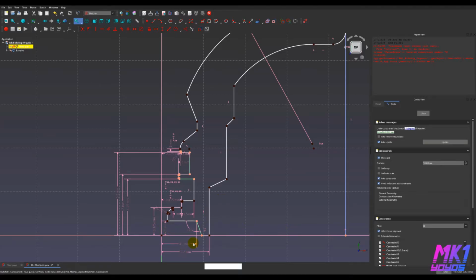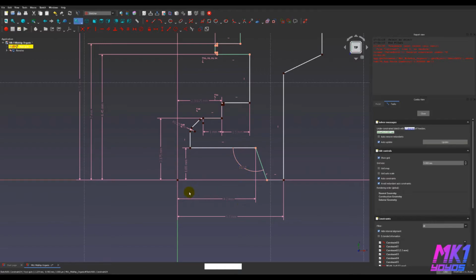So, quick note down here. The axle is 8 millimeters long on this design. So I've made the hole 4.2. This is on one side of it, so half of the axle will be here, half of it will be over on the other side, and the cups will be 11.4 millimeters apart. That gives them some space between them, including any angle that's there from drilling the hole out.